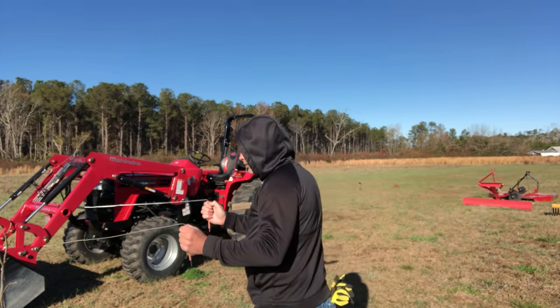Okay, so we got a little problem here. Kept drilling. We got down 16 feet, 18 feet. The suction built up, and then the sand became real fine coming out of the hole, which is typical of water sands. But I thought there's no way that we're already there. There are wells around here that are 18, 19 feet, but I was really expecting to be somewhere in the 30, 32 foot range.